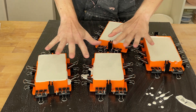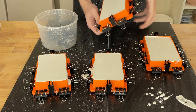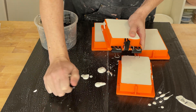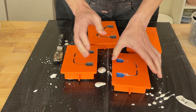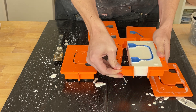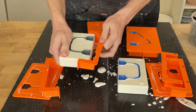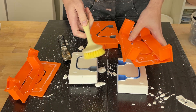The plaster is all set and is cooling down. It's been maybe an hour or so, a bit longer. So I'm going to go ahead and take off the outer molds and then we'll decide what we want to do with the insides. Remove all the binder clips and then take off the tape from the bottom. These should demold just like all the other handles — pull the bottom off, pull the sidewalls out. Wash these off if you want to reuse them; I just use a bucket of water and a brush.